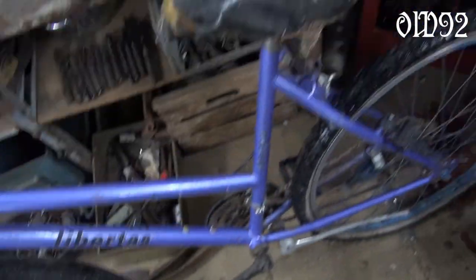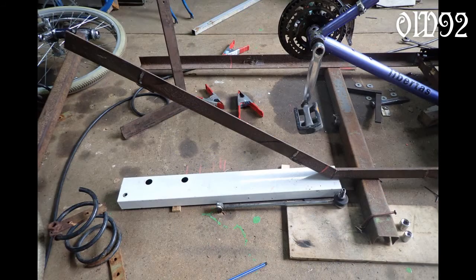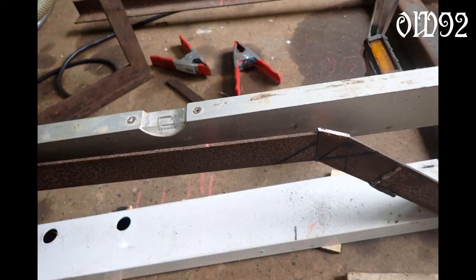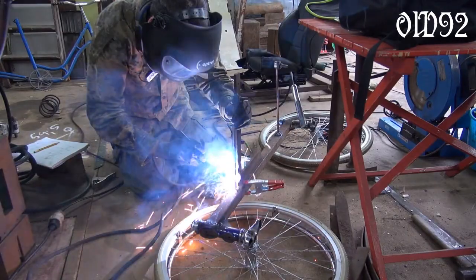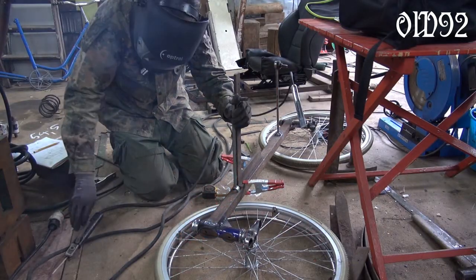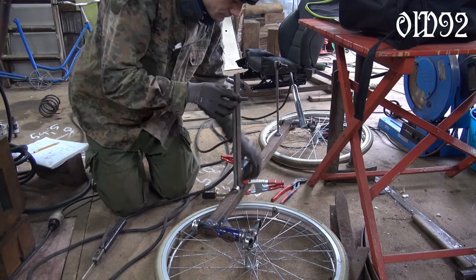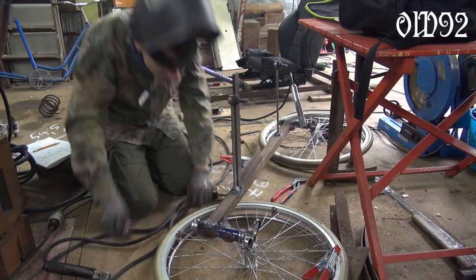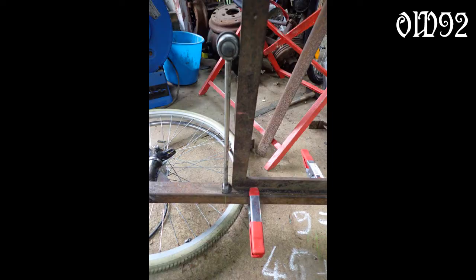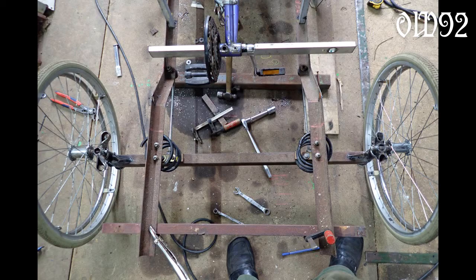I did some little progress until I needed some bicycle parts again — this time a proper bottom bracket. With the new bottom bracket in place I continued work on the frame. I had to lift the front part of the frame because my front axle needed some space. Here I am mounting some stabilizers onto my front axle, bolted out of some car coupling rods. And the front axle is finally mounted. As you can see I chose simple car springs instead of leaf springs.